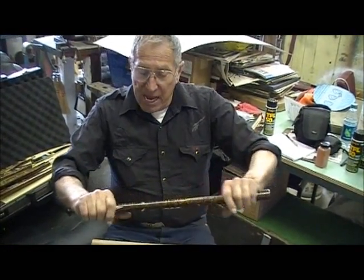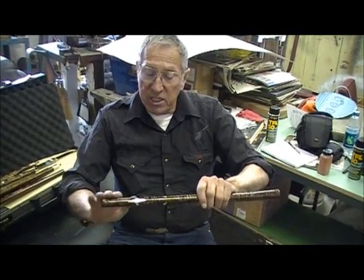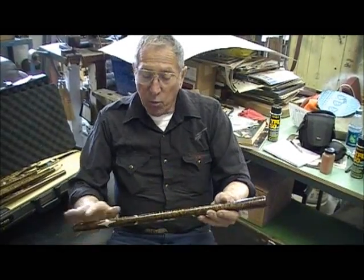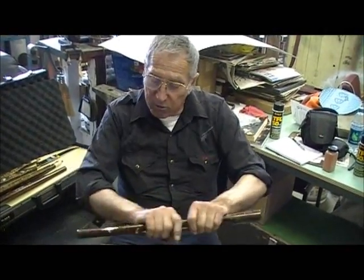So now you sand it down. You put one more coat of stain on it. You don't need to put it in sunlight. It'll turn all about brown color. So you sand lightly again with probably a thousand grit, until you just get some white stripes — like this right here. When you get that, you're done sanding. Just lightly sand it down to about 2000, just over that, so you're not taking nothing off.